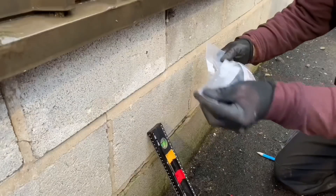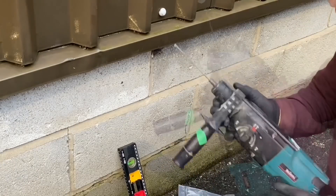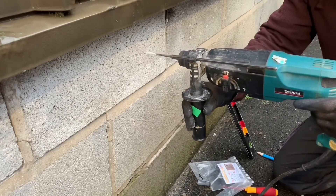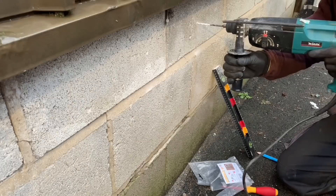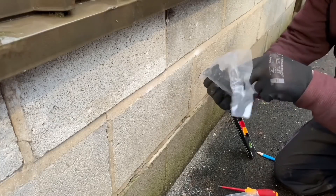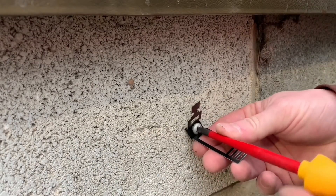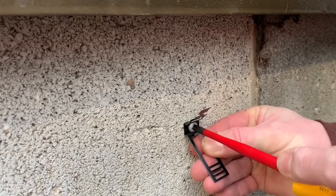Select the appropriate D-Line EV cable fix impact based on the diameter of the cable you're using. It comes already with the 5mm SDS drill bits — that's a really nice touch. Remember, we only need to drill the holes out; there's no need for a plug of any variety. We're going to screw straight into the fabric of the building. Those screws are 35mm long and the width of the head is 10.8mm. It nestles in super tight inside the clip itself. Just screw it into the fabric of the building — it will grip really well. You can almost see how much it's biting into the fabric of the building as I screw it up.